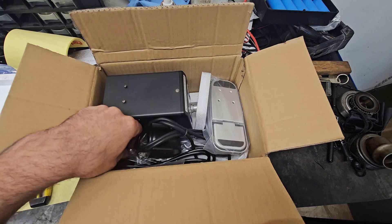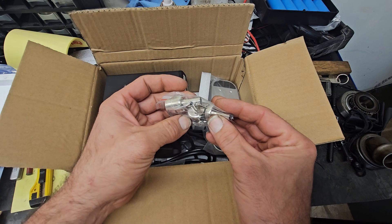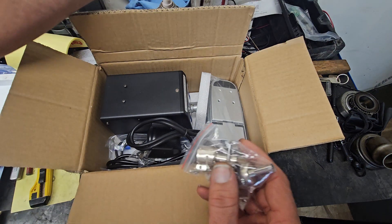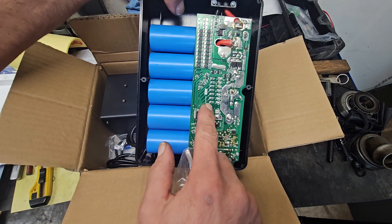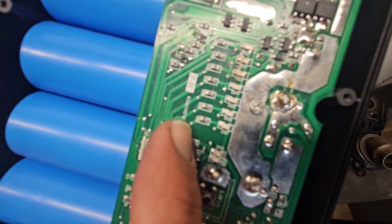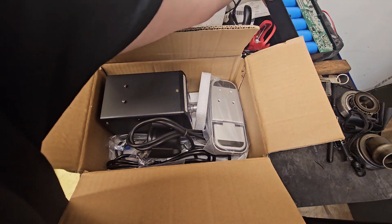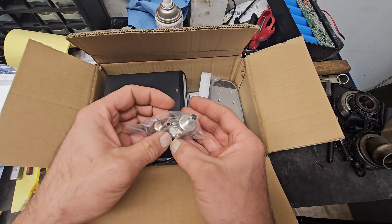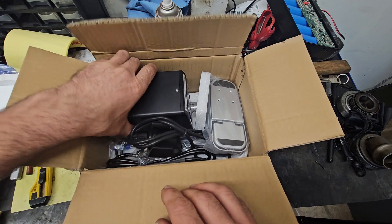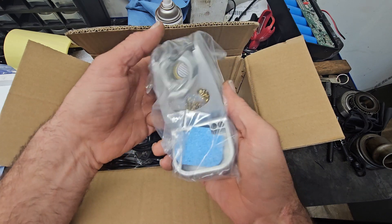Oh, that's a lot of things — did not know what was in this box. So there's all the different tips, the hot air tips, because there's no real soldering iron you use to get these tiny little resistors off a board. Essentially you shoot hot air at it until the solder melts. You've got different tip sizes, that's nice. Let me get some of this foam out of the way.